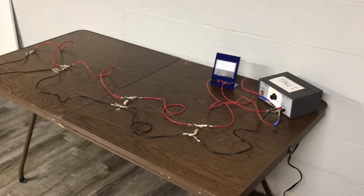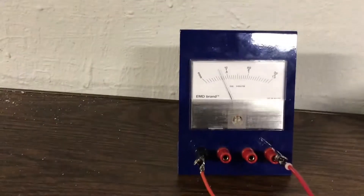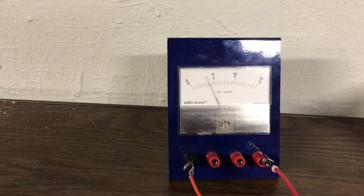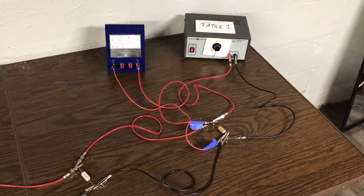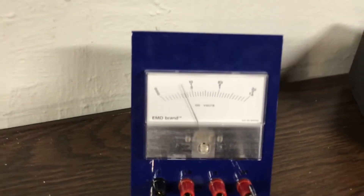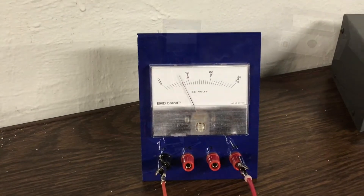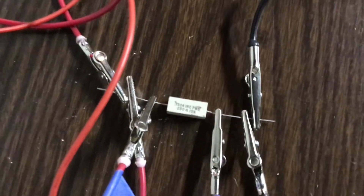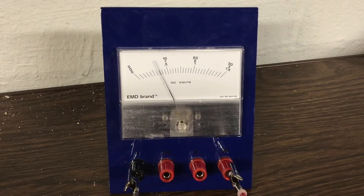We're going to measure the total voltage coming out of the power supply. I've got two pieces of blue masking tape to help you distinguish the wires. The voltmeter is on its highest setting, the 30-volt scale. Go ahead and make your measurement for the total voltage for the circuit. Now I've got the voltmeter connected around R1, the 1k or 1000 ohm resistor — still on the 30-volt scale. Go ahead and make your measurement. Now we'll do the voltage for R2, the 250 ohm resistor, still on the 30-volt scale — go ahead and make your measurement.